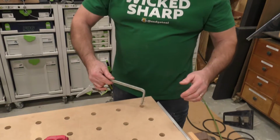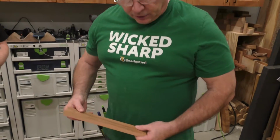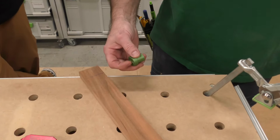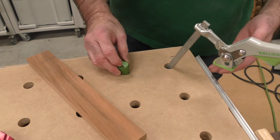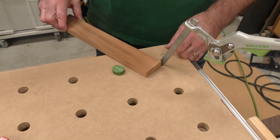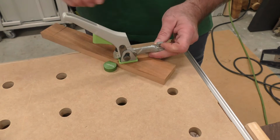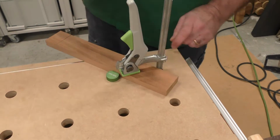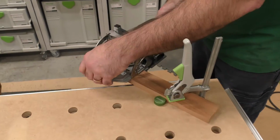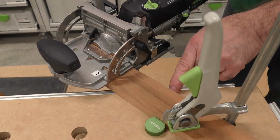I first take my clamp here like this. And I'm going to grab, well, thank you, doctor. This dog here is perfect, and this is the perfect clamping area. See how I've created this channel? I believe this is 50 millimeter. I can take it like this, and look, that's my stop. So I'm going to position it here, grab this like this, and it's really important to always double check this.